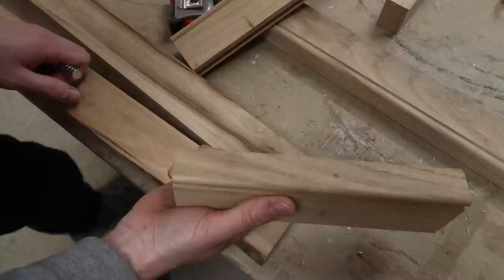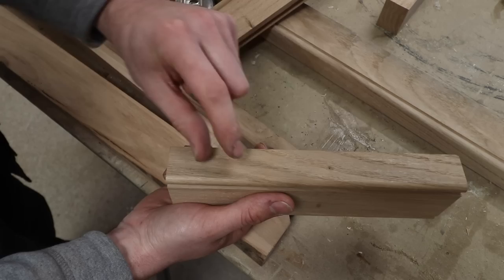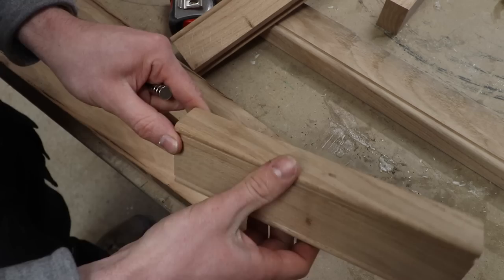The only other way you can do it from the face is if you peel a bit of the grain back and then drill a hole and then glue that grain back down, but that's not quite as good as doing it this way. But you have to do it in advance to get this in with the mortiser, so we'll offset them out. I'll just quickly mortise them through now.